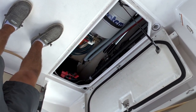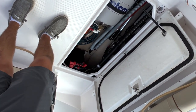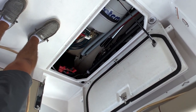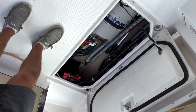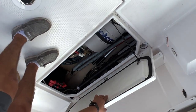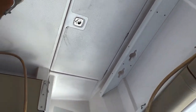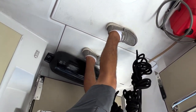However, I am going to be putting in a deep cycle battery, which gives you the option, say if your house batteries are flat dead and you needed to pull power, if you back paralleled from the engine over, you wouldn't have to worry about the battery dying. The deep cycle battery has an amp hourage that this one doesn't have. But that's just me doing that. Most people do put that one in, but I'm the type of person that likes to do a couple things differently. And that battery in there is better than the one that was there, much better than the Centennial battery.